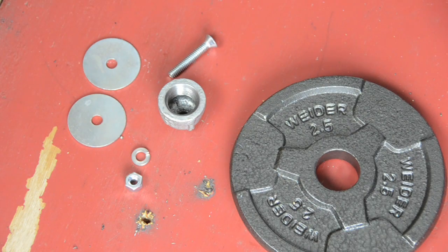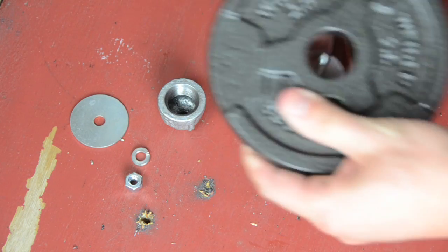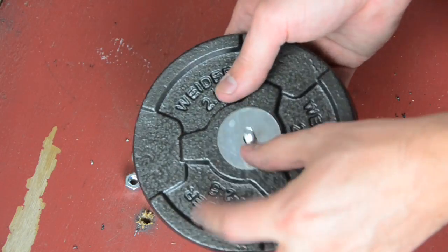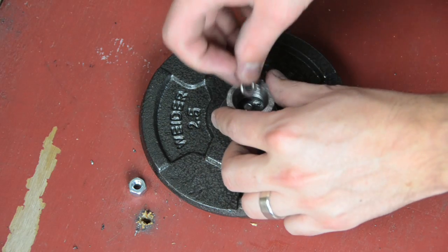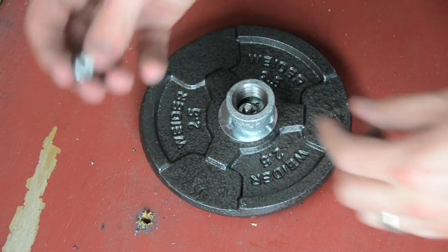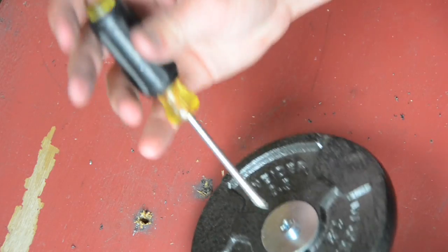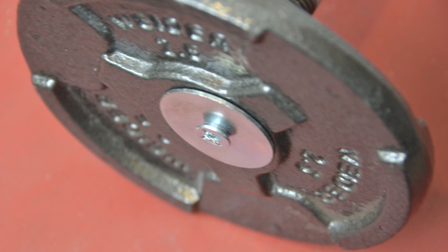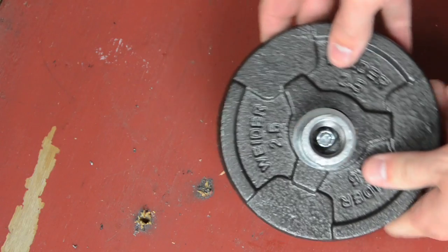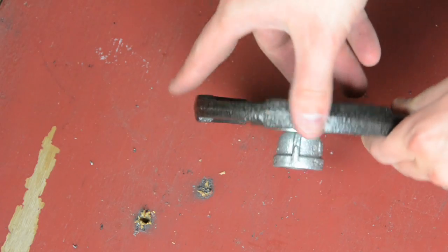Here's what you're going to need for the weight side. Take the bolt, put one of the flanges through, then the weight, then the other flange goes on. Here's the tricky part: put the end cap in, then the locking washer, then the bolt. Use needle-nose pliers to hold one side and screw the other side. One side is going to have the flange and just the end of the bolt, and the other side is going to have the nut on the end, then the locking washer. It's going to look like that.